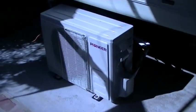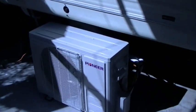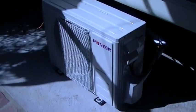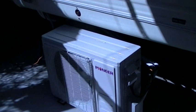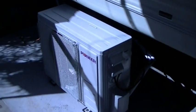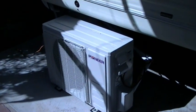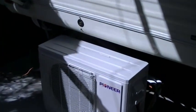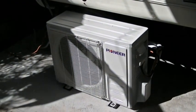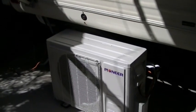It's a surprise — it's not mounted to the trailer. This trailer is permanently parked and won't be moving, so they decided to save money and not build custom framing to mount the unit to the trailer. Instead, they bolted it to the concrete slab the trailer is permanently sitting on. If it ever has to be moved, the lines will need to be disconnected after removing the refrigerant, then reconnected and recharged at the new location. We had that thing cooled down very rapidly, and put it in heat mode on a 78-degree day — it cranked out heat so well we had to leave because it was so hot.